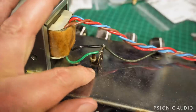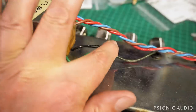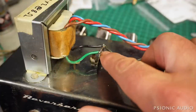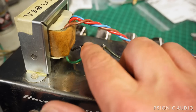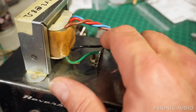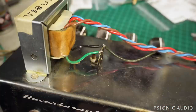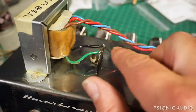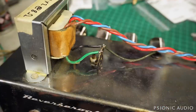Here you can see I have that terminal strip now, which gives me a place to anchor these two wires, and I can anchor the actual wires to the speaker from here. Now I just have these temporarily connected, because this is how they had the colors connected — black to output, green to ground, which is where the negative feedback is. But I have no guarantee that that's where it should be. If those need to be reversed due to oscillation from the negative feedback, I don't want a permanent thing yet. I want to make sure it's working first.